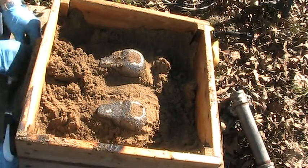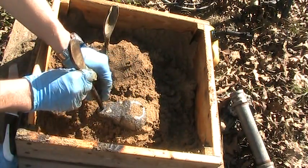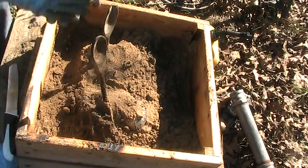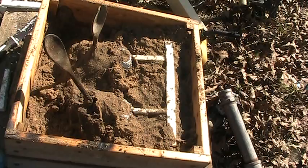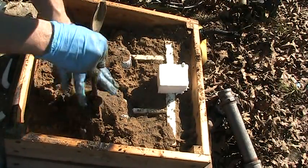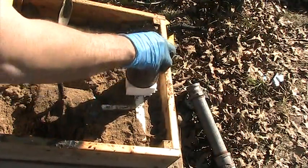I need to get my vents ready. I got them pretty close, and now I got my runners ready. Now I'm going to take this block of styrofoam to give it head pressure, and I'm going to put my can right on top.